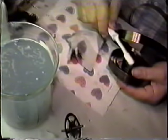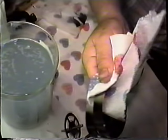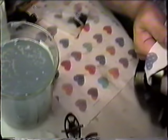And you take another dry piece of towel and just dry it off the same manner. Just pull it on through. And we oil it the same way. I'll take it up, put a little bit of oil on here, and I'll lace that through, and that'll be enough oil on that mainspring to keep it lubricated. Okay?